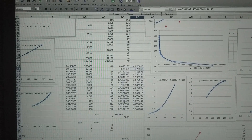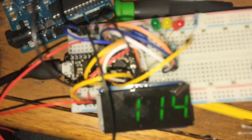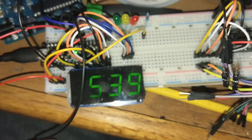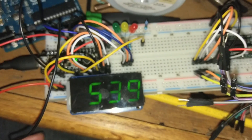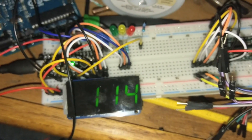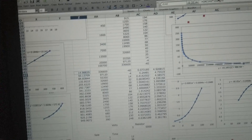Now that we know what the voltage is, we can then convert that again into what the Arduino sees. The Arduino has a bunch of analog pins - all along the bottom we have those A's, those are analog pins. When you read an analog voltage, it's going to be anywhere from 0 to 1024. I think it's a 10-bit analog-to-digital converter. What we need to do is take that 1000-some number and turn it into something useful, like a temperature. We can do an equation to convert our 0-to-5 scale to a 0-to-1024 scale.